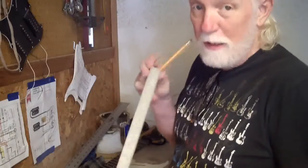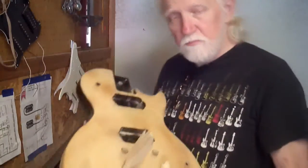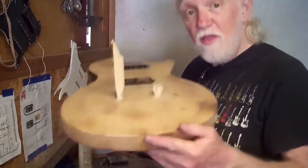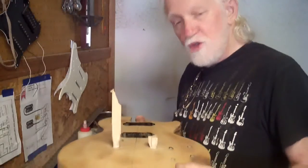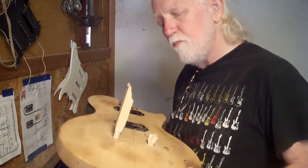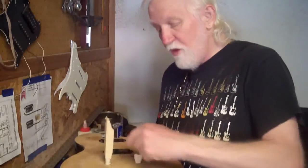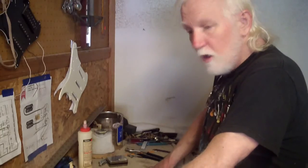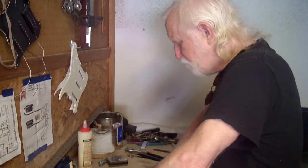I find that good expensive measuring tools are always worth the money. I had to make a run to the hardware store for some metric bolts to fix a fender, then came back and took some poplar boards and split some pieces off of it, whittling the ends into plugs — same poplar I used for the front of that sandwich guitar I have yet to finish. I drove them in there with some TiteBond and went around the edge with some sawdust. When this dries I'll cut these off and start sanding them moderately level, then finish with glazing putty since I'm definitely going to be painting this.